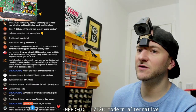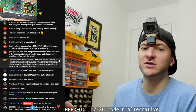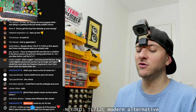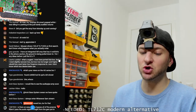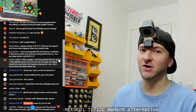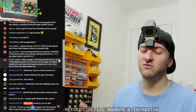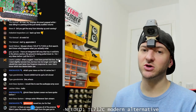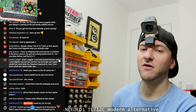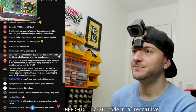So you may find that there is a ground reference missing, and I don't know the amplifier that you're referencing, and I don't want to advise you do something that may cause more damage, but whenever I've got a voltage on something that should be ground, then I tie that directly to my main ground, my power supply ground, and that then gives the correct ground reference, and I can see if the circuit starts behaving as it should. But yeah, I don't know your amplifier, and obviously you need a current limited supply to do that. So yeah, difficult one that.